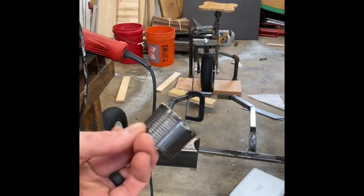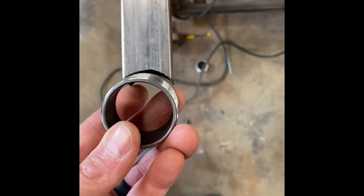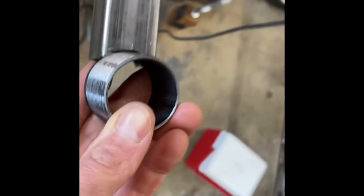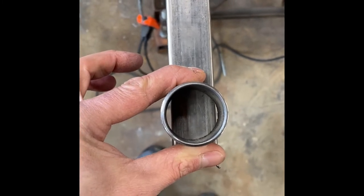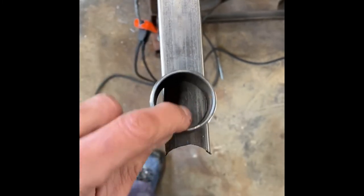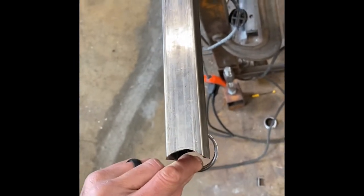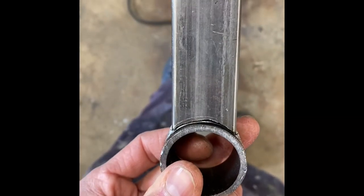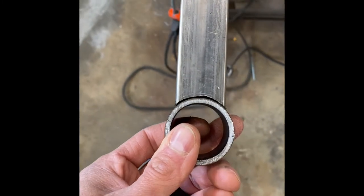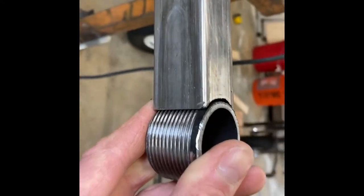And once you have your lines down the side, then get a spare piece of the pipe you cut off, the exact diameter, and all you do is, obviously I've cut this, but you line up the diameter, you just put it pretty much in the middle. So imagine that, get daylight about even between, about there. And that's how I made my circle. And all I did was connect my lines. So on the bottom, since it's angled, it's going to be at a 5 degree slope. So now, it's not exact, but I'll do a little bit of trim up to clear up these edges, but other than that, definitely a nice heavy duty weld will fill that in. The ends look really good.